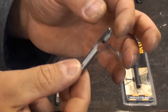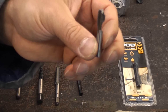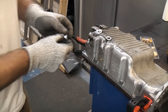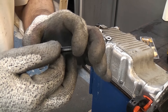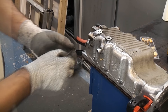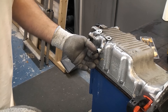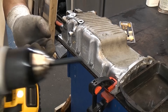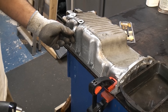This kind of steel is incredibly tough and very difficult to drill — you have absolutely no chance with a normal or cobalt drill bit. I'm going to take the drill guide I've made — a shorter version — and tighten it in there. To drill out the broken tap I'm going to use a 6.5 millimetre diamond hole saw, which is a perfect fit. I'm going to dip it in water every five seconds — this is going to be a very long process but it is one of the few ways we can actually drill out a tap.